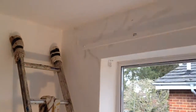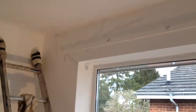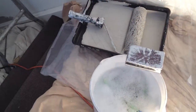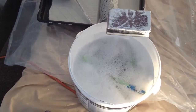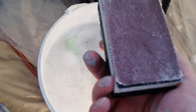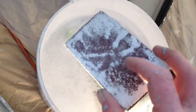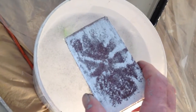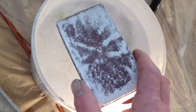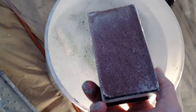We had some cracks up there that needed filling. I've used Polyfilla — a five-minute or quick dry filler in the tube — and then I used this Mirka sanding pad with the Velcro on it. Now that's 80 grit on one side. See how you sand it a little bit wet and all the crap goes into the Mirka. Then you come over here and use a little scrub brush to get the stuff out.